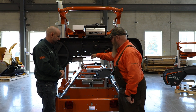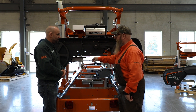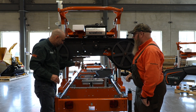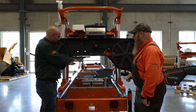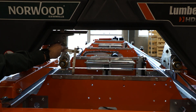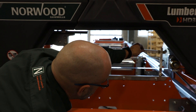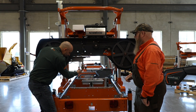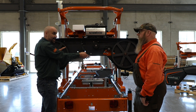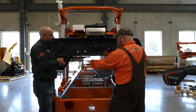Let's talk more about the down pressure — how much down pressure should someone be applying when they're pushing down on that blade? When the blade is set up true across the band wheels, I'm going to loosen these two bolts off and slide that roller down to deflect that blade down about an eighth of an inch. I'll install the rollers on both sides, deflect them about an eighth of an inch down, then take measurements from the blade to the bunk on both sides, and fine-tune it so it's the same on both sides.